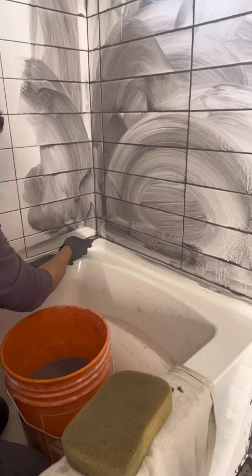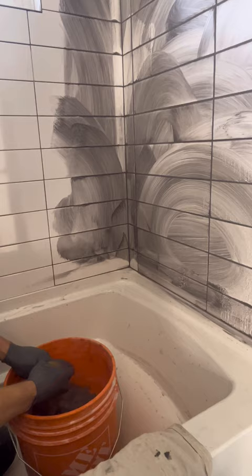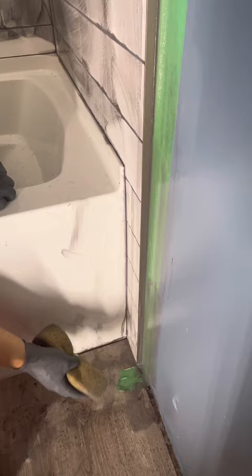I'm going to use my knife to clean some of the excess grout out of the corners, then use my sponge to smooth it out like the rest of the grout lines. After the whole wall is done, I'm going to clean anything I might have gotten grout on, like the tub or the floor. We're going to use more pressure to wash the tile edge — force the sponge into the corner with your fingers and work from the top to the bottom. If the sponge ever feels too gummed up and isn't working effectively, just give it a good wring out.